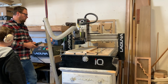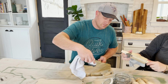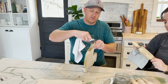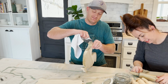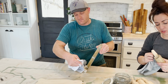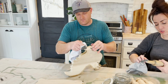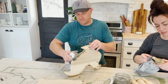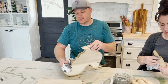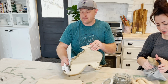You can also just water down the milk paint and do that and then do the hemp oil as a sealer, but we like to cut out a step. Yeah, we're less step people. Let's do it all in one right now. One and done. The more layers you put on as they dry, the deeper, darker, richer color you can get. And then over time, you can either use this stain again or just straight up hemp oil, if you need to reapply, which I haven't had that problem much. We use ours as actual cutting boards quite a bit, and they just get nice and seasoned. I say a couple coats is good.